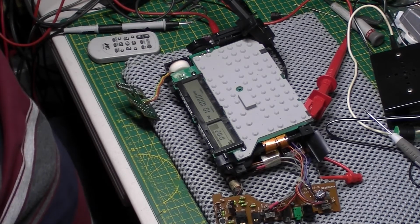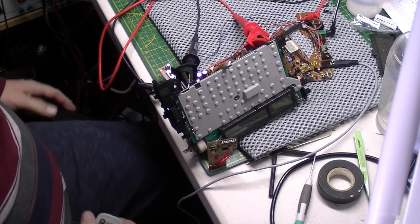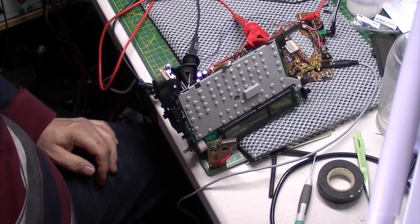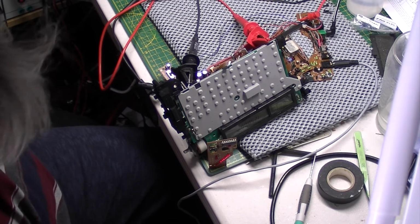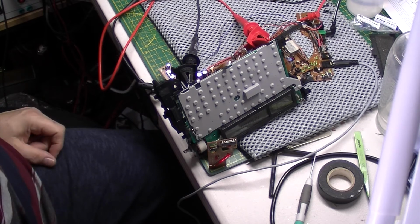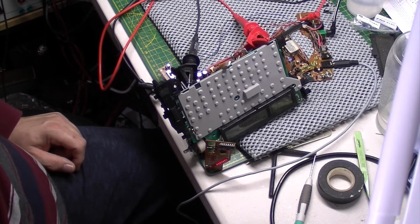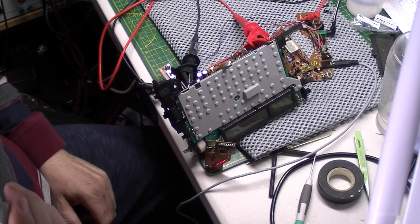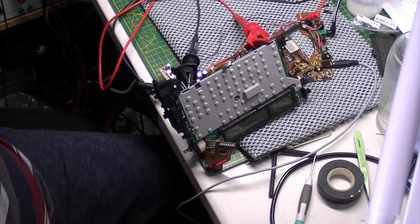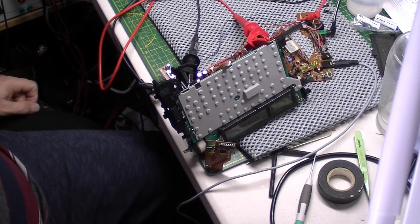Let's just see if this will work on my other speaker a minute. Okay, well, I'm just trying some signals across this because I can hear hiss. I'm just wondering if I can get any signals across it. And I'm just injecting 100. Well, I've just got a telescopic antenna here, really, and I'm sticking it at minus 32 dBm just out into the room, and it's picking it up on airband, which is strange. I'm going to try, let's try it on FM. So let's go back, let's do 101 megahertz, no 100 megahertz, no 101 megahertz.